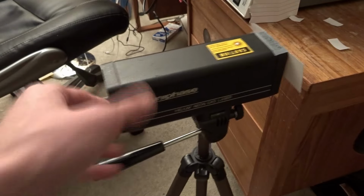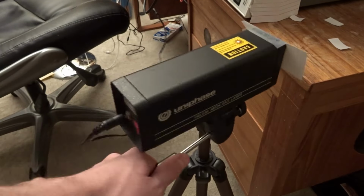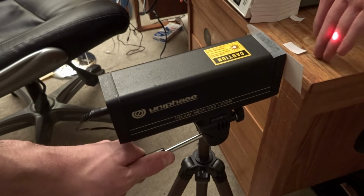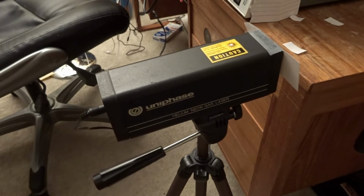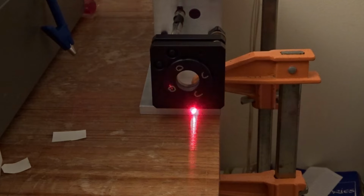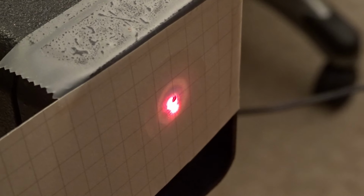So how are the mirrors aligned? The easiest way is to use another laser. A high-quality helium neon laser is best, as it will have a very well-collimated beam. In theory, if you place a card with a hole over the output of this alignment laser and shoot it down the two mirrors, when the mirrors are in perfect alignment, the beam will go right back into the laser and you will have an interference pattern on the card.